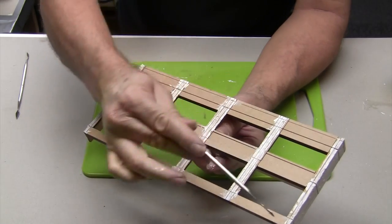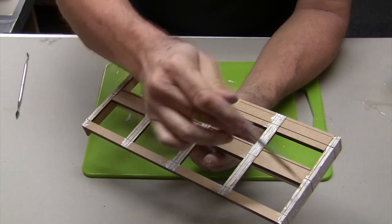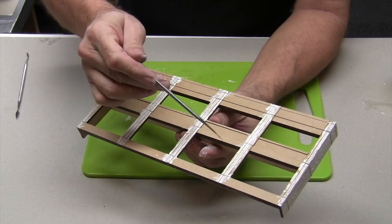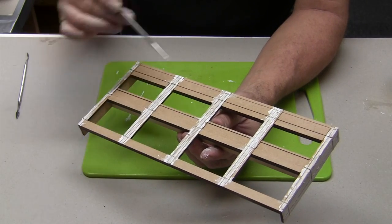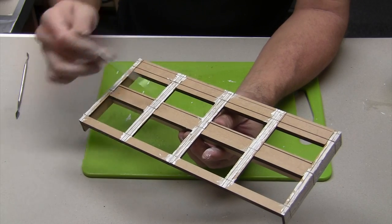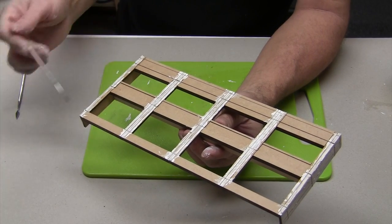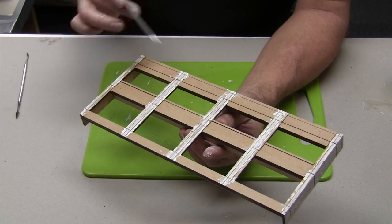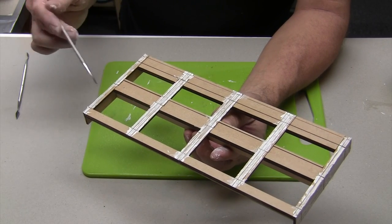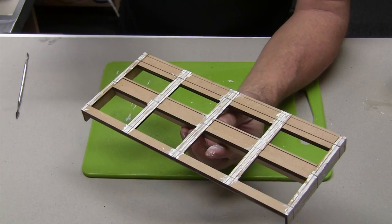Okay, so I've now put all of the little plaster on. I've scraped out the lines that I want to keep, and it's actually drying up really quite quickly because the coat is very thin. Nevertheless, I'm still going to let it sit for a good hour because I want that to be nice and dry. And when I first start to sand it, if it doesn't feel like it is, I'll leave it for another hour or so. I'm not really in a big hurry. My experience tells me that a little bit of patience with this process gives you a great result.